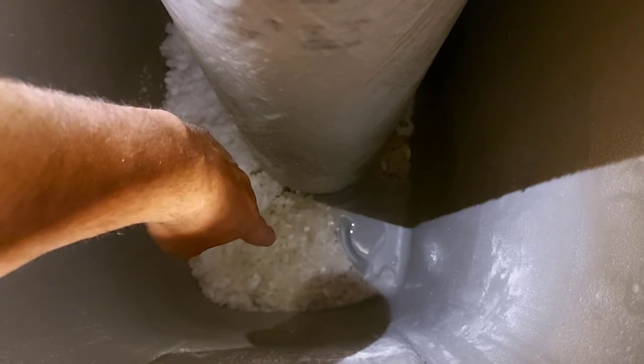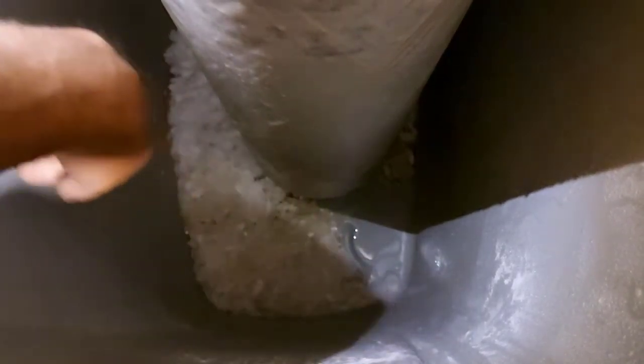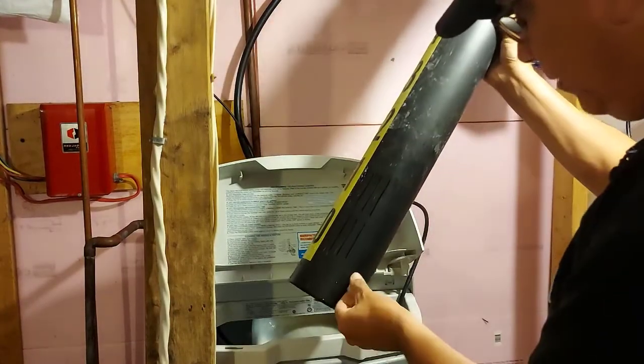This time I cleaned it right out. That was a mistake I made and I learned from it, so this time I cleaned it out perfectly. When I put the tube down there, it'll be flush with the base of the salt tank and there'll be no more salt clog inside that tube. Not only did I scoop it out with an ice fishing scoop, I also used my shop vac to suck up any water so I could see that corner right down in there and make sure it's perfectly clean.